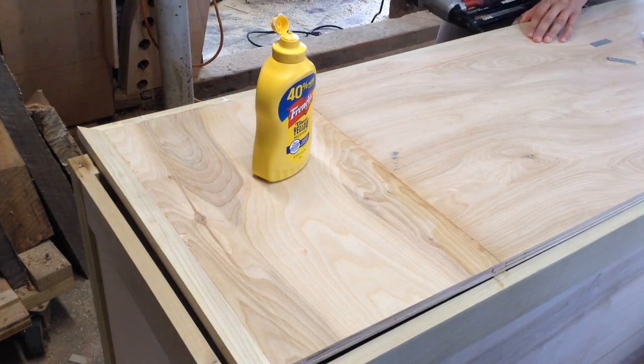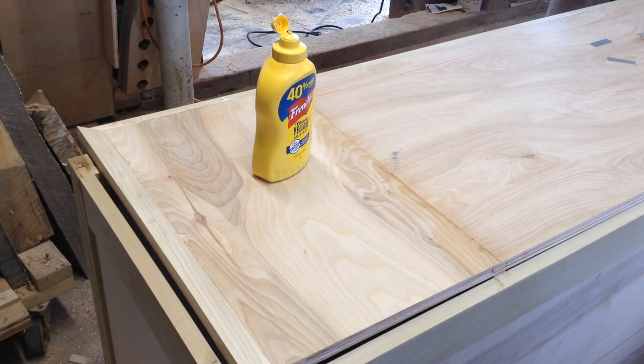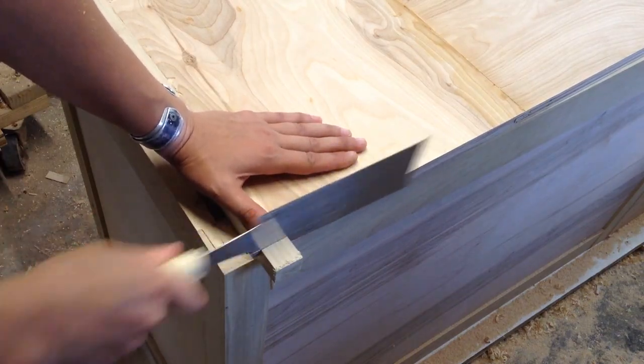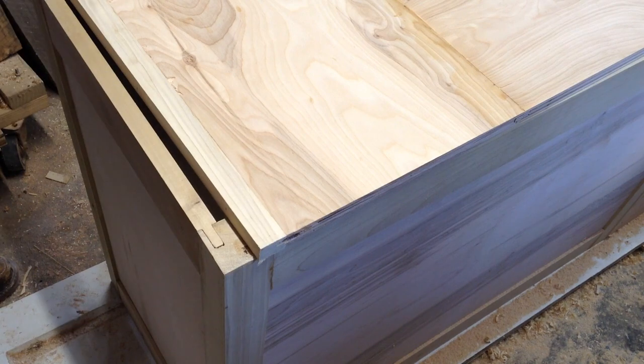And then I think I show the miter in the center. Instead of putting a butt joint, which could kind of peel away from each other, that miter in the center is just a much stronger joint. So this is just trimming off the back once it is dried.